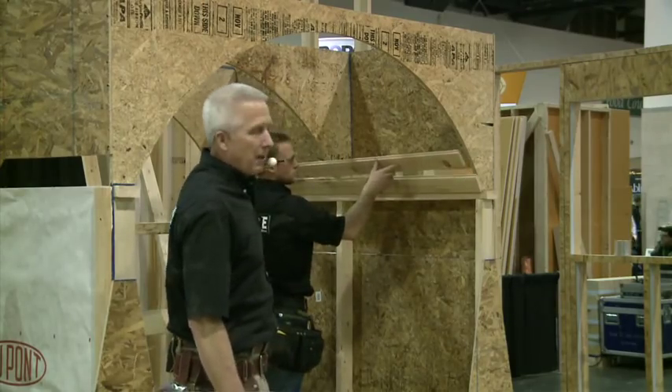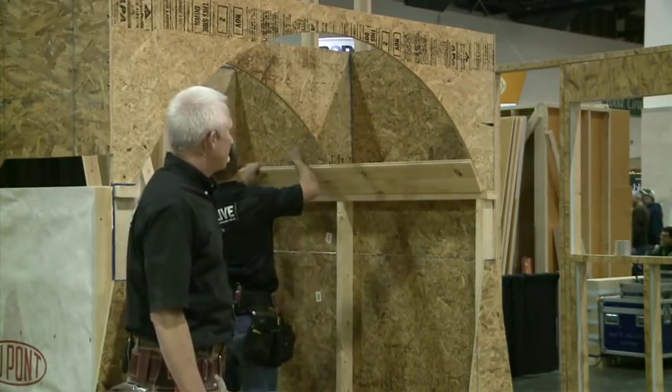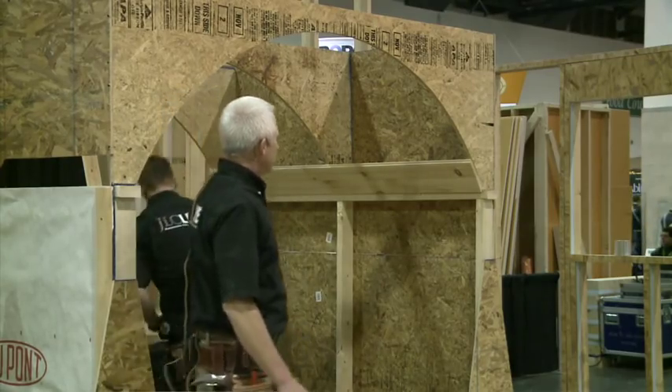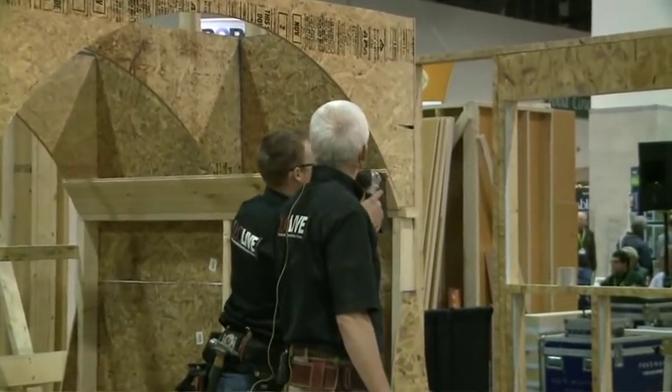You don't need stainless or galvanized. If it's inside an area - if this were out on a porch, I'd use stainless steel fasteners to make sure they don't rust. But inside, we're just going to be shooting it on and, for the most part, blind nailing it - shooting right where the tongue and the groove meet so that we're not going to see it.